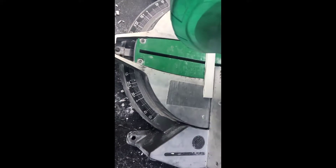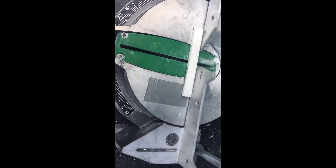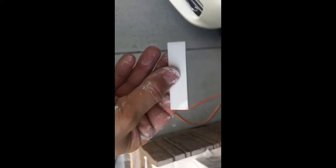Instead, I bought a tile blade for my chop saw, but it still leaves little chips. So what I'm gonna show you today is your best friend in a tile project — it's a must-have for small detail work. I'm getting ready to make a cut and I'll show you the finished product. As you can see, the edge is kind of rough, with little chips. The secret is a Dremel with a diamond blade, and I'm going to show you how to smooth out the edges on your tile.